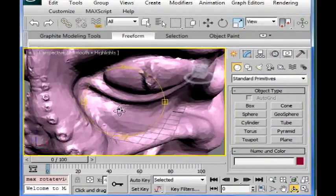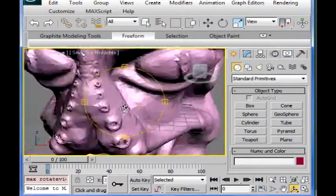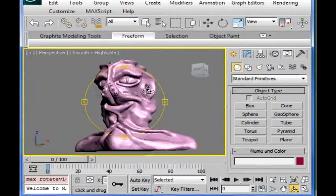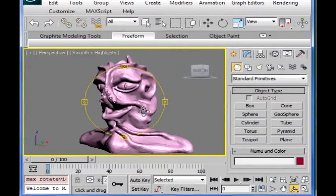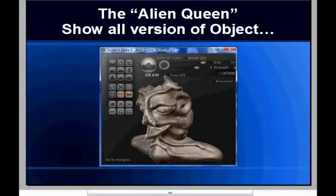Yes, it looks a little bit boxy and doesn't look as great now, but it'll still turn out okay once you end up building it. So I bring it into Max, reduce the polygons, and then I also cut the bottom to make it nice and flat to make it work. And then at that point, you can export out of 3D Studio Max an STL file, which is the file that gets brought into the RepG program.